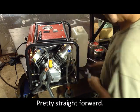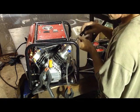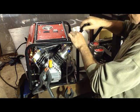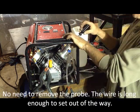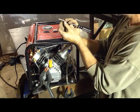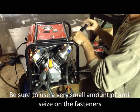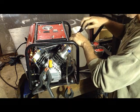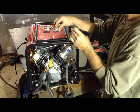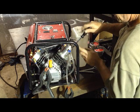Get that up out of your way. Then all you need is an allen — there are four socket head allens on the top and a temperature probe. Bear in mind this is aluminum with stainless fasteners, so you do need a little bit of anti-seize on there. When you go back together, put just a little dab on the threads. Take these four bolts out — bear in mind they have lock washers.